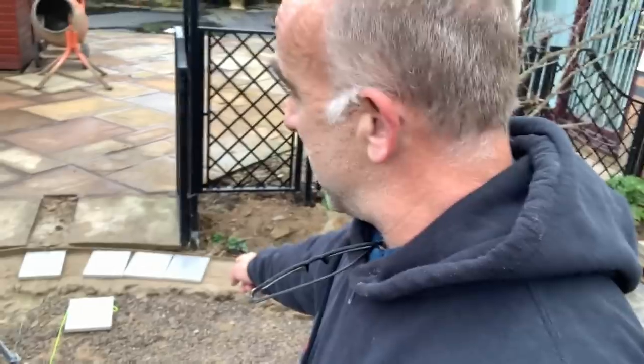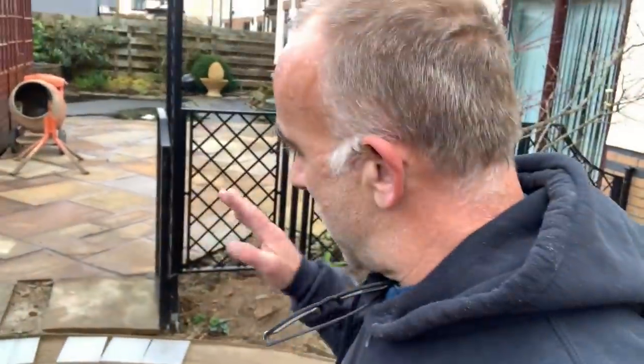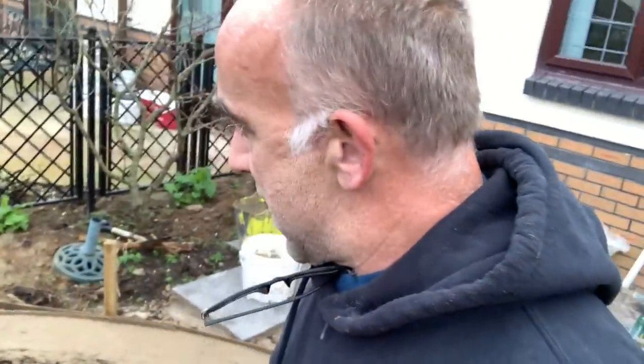I'm gonna have a go of the circle. As you can see, circle. See the cement I've done all the way around it? So I did that the other day to allow me to cut the cuts and to lay them all down dry, so I can go right the way around the circle, because the last thing I want to do is hole one, and by the time I get all the way around to the start again, end up with a little cut. So I put the cement down on the floor already. I still got a bed on top of it, but it just allows me to put it down dry so I can make sure it all works. 72 cuts I've just done.